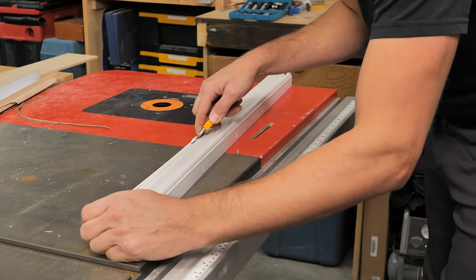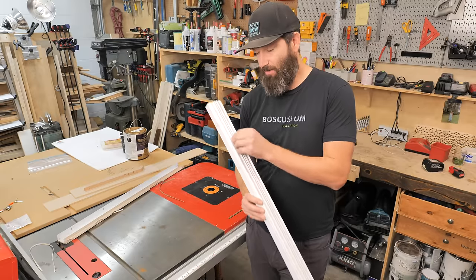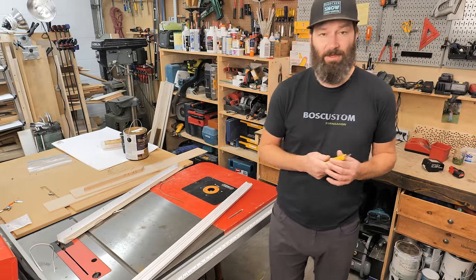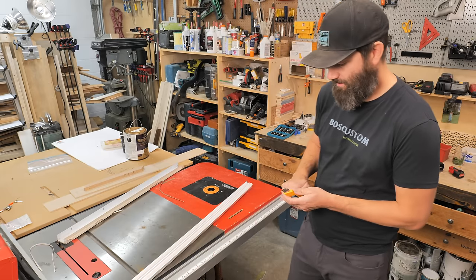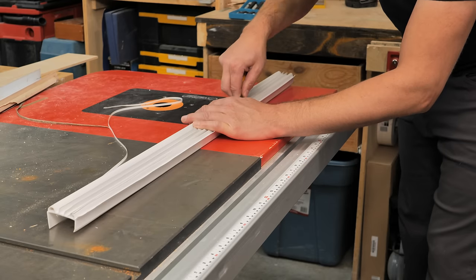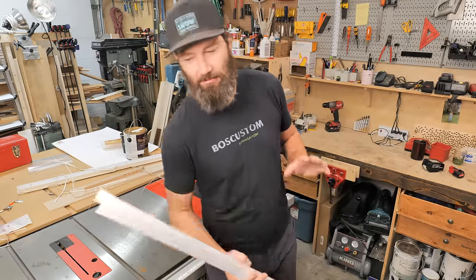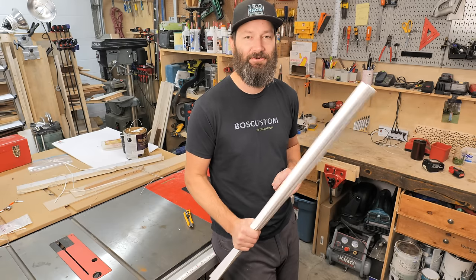To get this fitting better, we need to trim the front flashing and cut sections out of the little rounded-over parts — taking a little bit off the center of the two fins. The best way to do this is with a razor-sharp utility knife; get a fresh blade because otherwise it'll make a mess. The technique is to stabilize the knife against your finger. The blade is sharp, but as long as you're not slicing you won't cut yourself. That's all trimmed up. It might take a couple of passes back and forth to get the perfect fit.